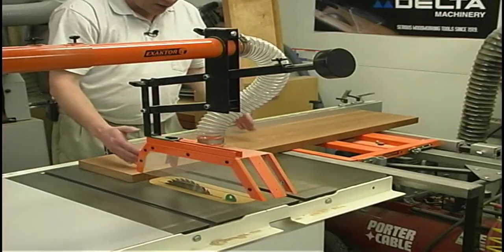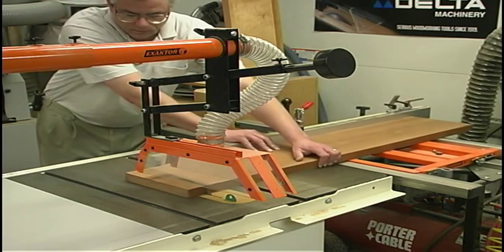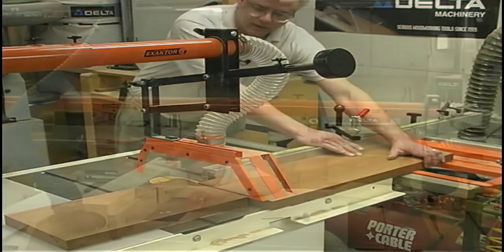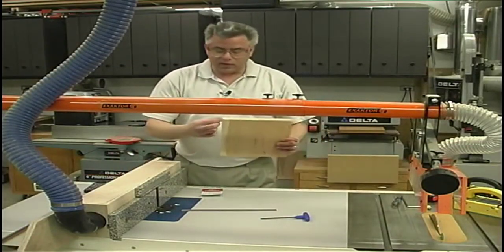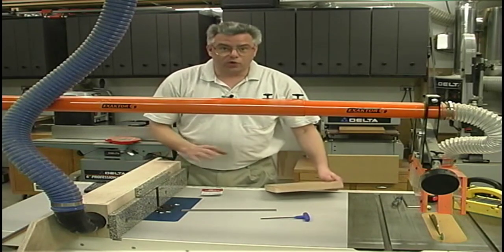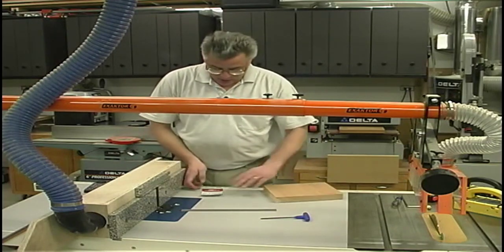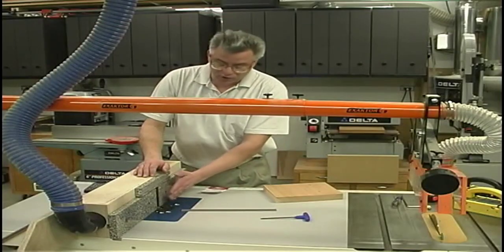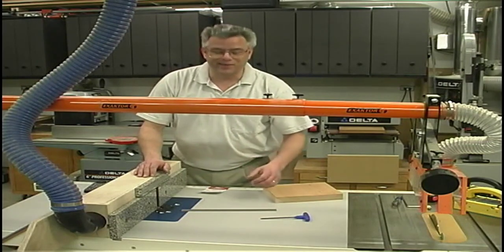I can now go ahead and cut away the top and the two legs. The top I'm going to cut oversize, but the two legs I'll cut exactly to their proper length. What I'm doing now is getting set up to machine the rabbet that goes along the back inside edge of the legs. It's a quarter inch wide by a quarter inch deep rabbet. I've installed a three-quarter inch router bit in my router table, raised it up a quarter of an inch, and set my fence back so that I'm exposing a quarter inch of it.